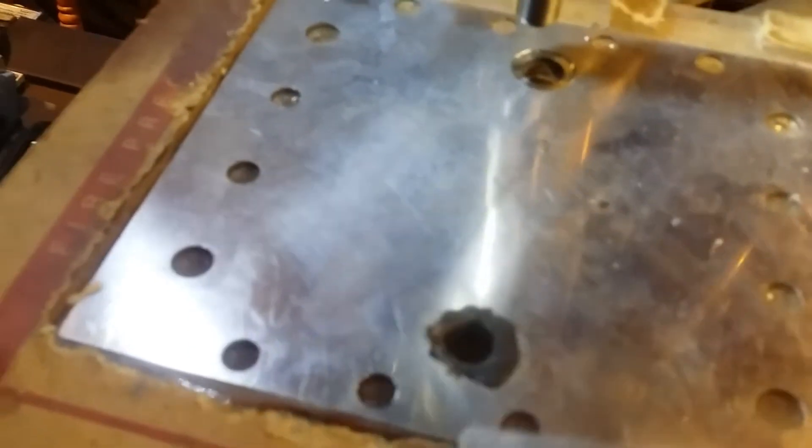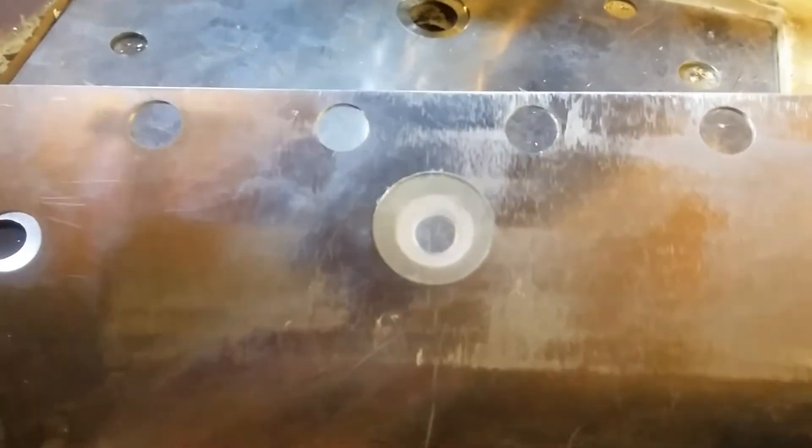Everybody's trying all kinds of stuff — painting around the hole — but you can't really use bushings because you're only running about 60 thousandths gap or closer, so it has to be flush. What I do is belt off the excess on a belt sander and it comes out inlaid flush. You can punch any size hole you want, so you can try different water flows or gas outputs.